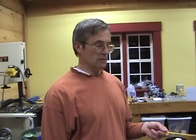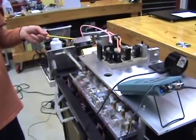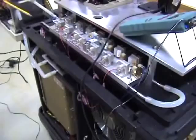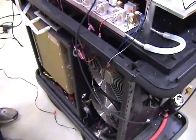I decided to produce this video because I'm making a new projector, a new laser projector, centered around a powerful yellow 575 nanometer dye laser. The dye laser is in turn pumped by a converted LS800 series double Q-switched 532 YAG.